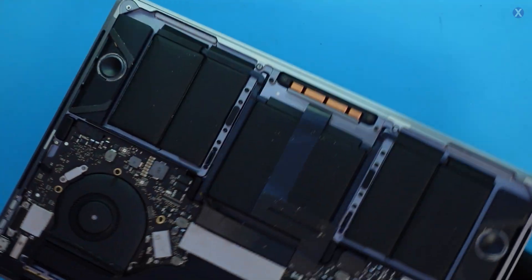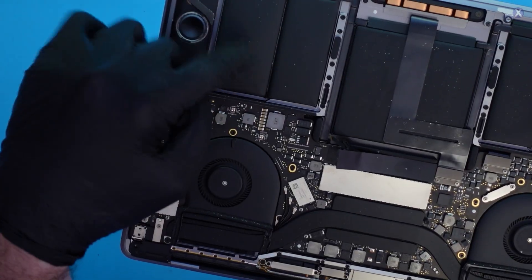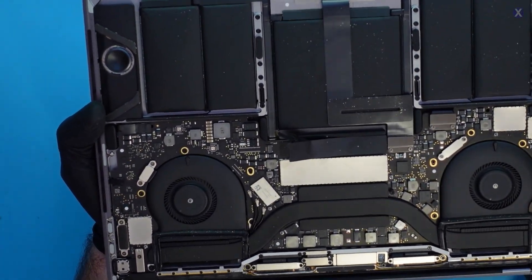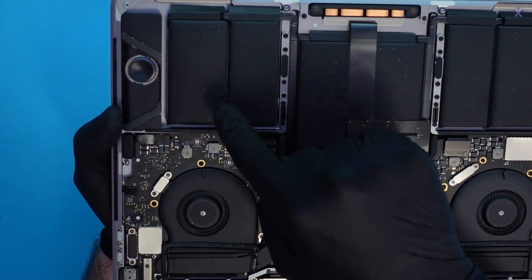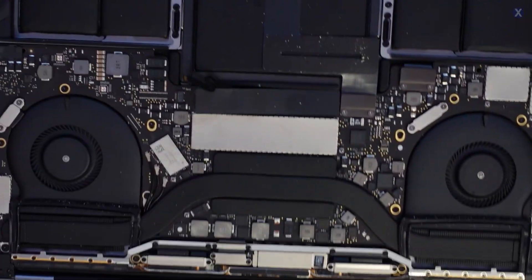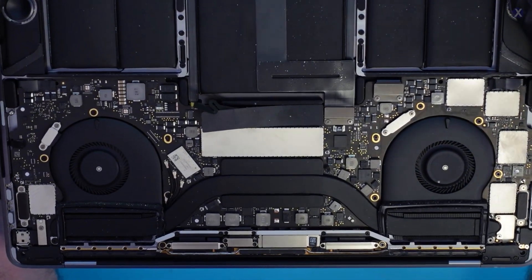We will still have to replace the battery because it's always a hazard. Most likely when we turn this on and connect the battery, you'll see a 'service now' warning — if not immediately, then very soon. That would indicate a chemical imbalance in the battery. We don't see any obvious damage or liquid spill; it looks very clean. So let's go ahead and remove the logic board and go from there.